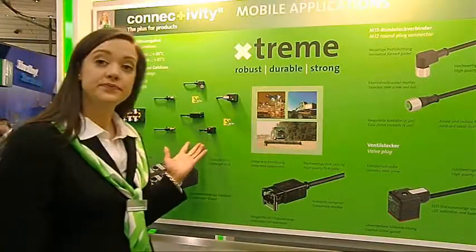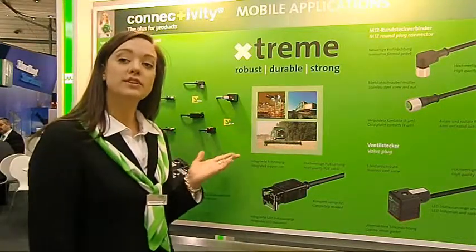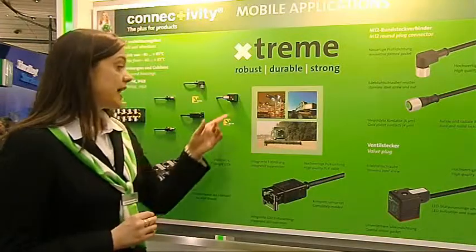Sensors are connected by optimized M12 connectors with a new two-way sealing system. Actuators like valves or rotary encoders can be connected by the valve plugs. The Type A plugs have an integrated LED suppression and an attached silicone seal ring so you can't lose it. The Junior Timer is a molded valve plug with integrated LED suppression especially designed for mobile usage. The resistant and translucent PUR material covers all the electronic parts but still lets you see the current status with an ultra-bright LED.